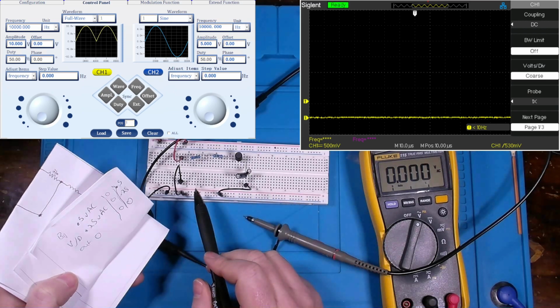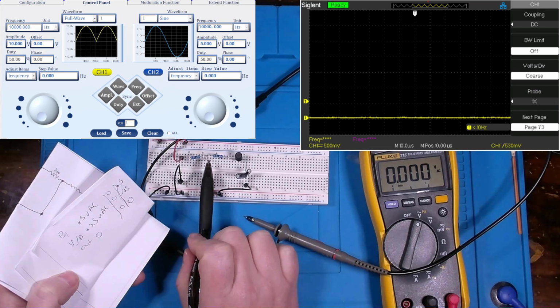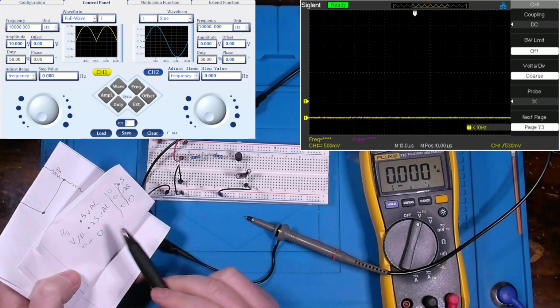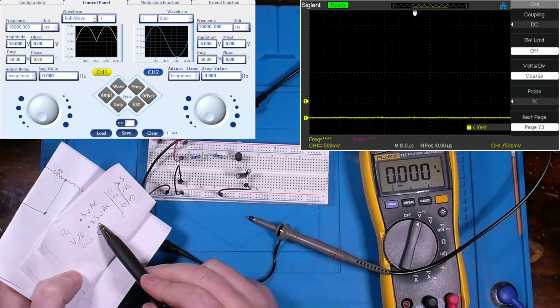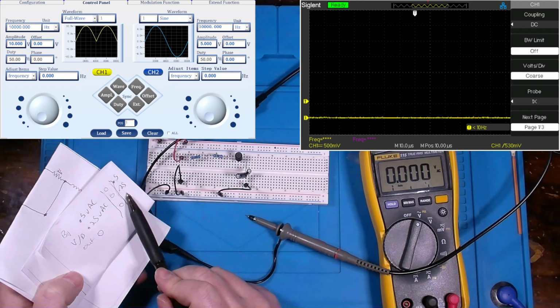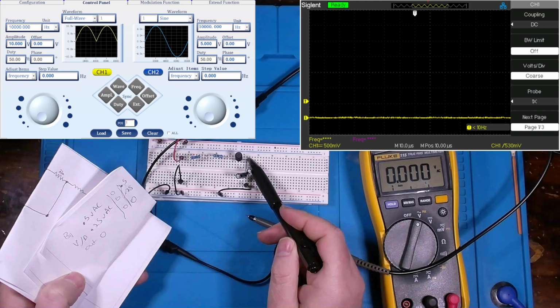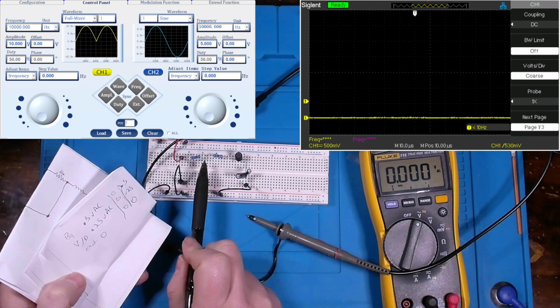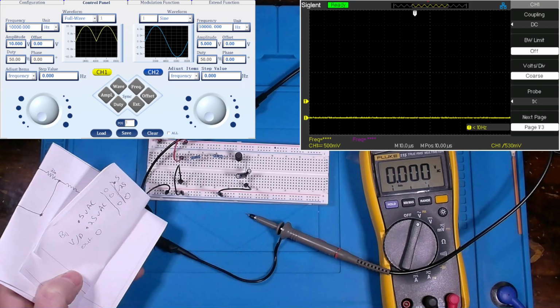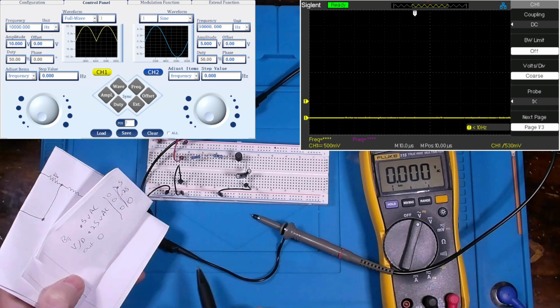The big difference is we either eliminate ripple across our entire series of resistors here and pretty up our signal, or we don't eliminate the ripple seen across these resistors. We just put the capacitor at the end. We have a cleaner output, but we still have ripple at these components here. Well, what might be the case in which we don't need ripple here, but we still need a pretty signal?